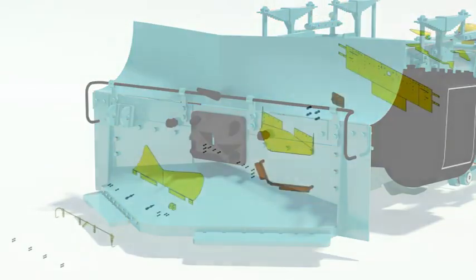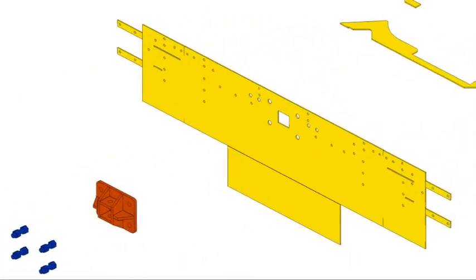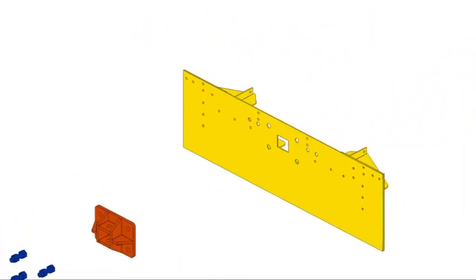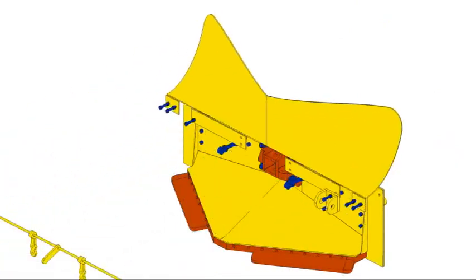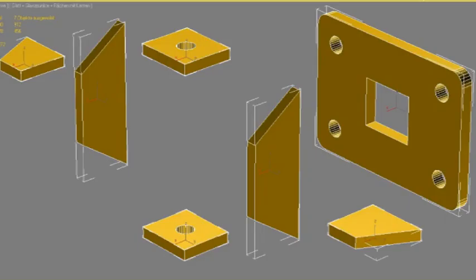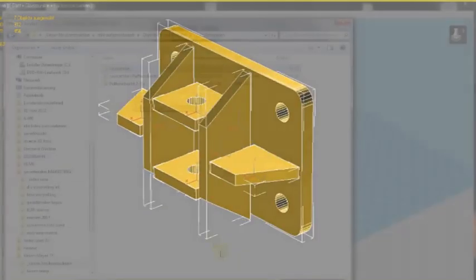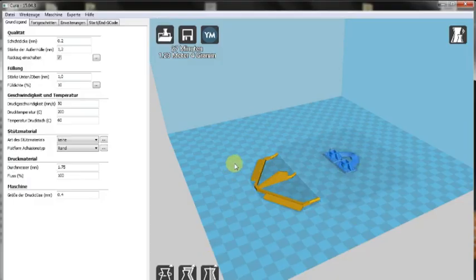In my model, the Cowcatcher consists of two castings and several 0.5 thick sheet brass parts, as well as screws and brass wire. The buffer shaft, as an example of cast parts, consists of simple geometric shapes.